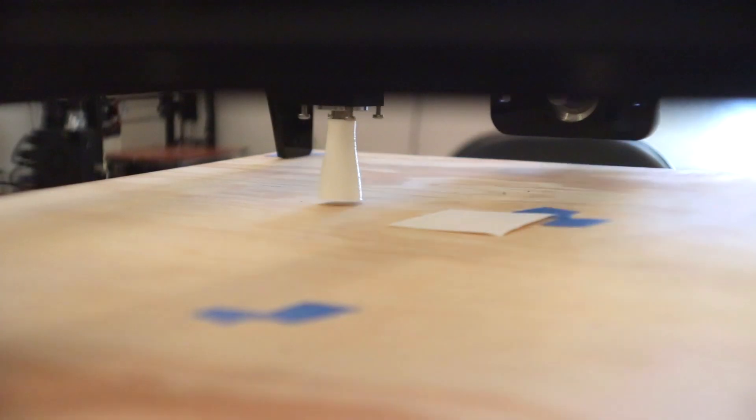Hello, my goblins and ghouls, my name is Steven and today we're working on building the Z-axis for the pick and place machine. If you remember from the very first episode, I had the nozzle very precariously positioned — that is totally not going to work for picking components and placing them on boards. So I need some ability to move the nozzle up and down. This is the final keystone of functionality for a bare-bones pick and place — it can pick things up and put them down, and that's fundamentally what this machine is going to be.